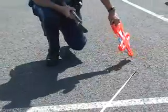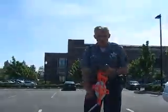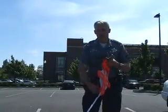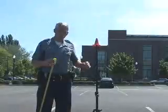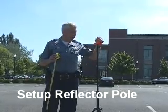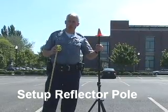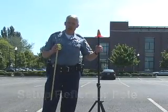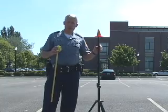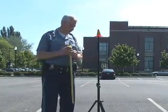If everything worked out well, that should calibrate to 50 feet on the pocket PC when we shoot our shots. Once you have your backsight point identified, if you have a second tripod or a man with a stick standing here, the height of that instrument needs to be identified so that everything correlates to ground level.